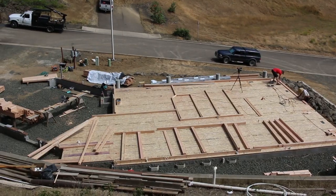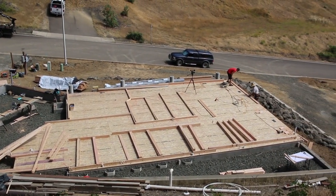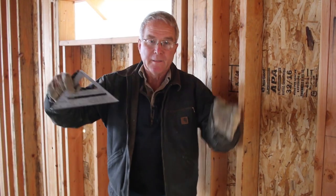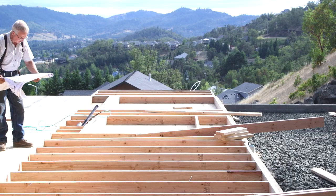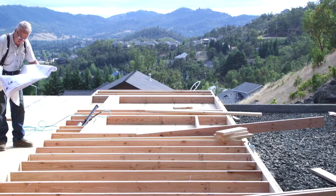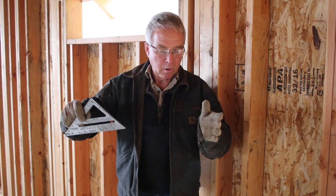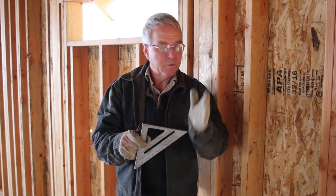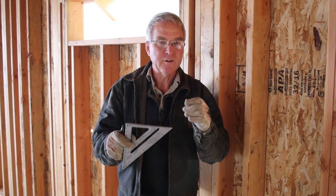When I started plating and detailing the plates, I was working on a deck with fresh chalk lines representing the wall lines, and the plates were laid inside those wall lines. The wall lines are fixed, so the first thing I mark on the plates is the intersections of the adjoining walls. Anytime a wall ties into another wall at a 90-degree angle, you have to be able to anchor the wall and provide sheetrock backing, and you usually do that with a channel.